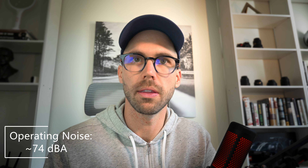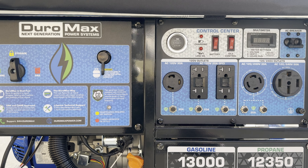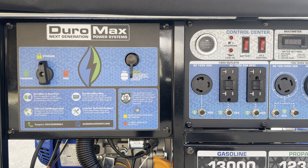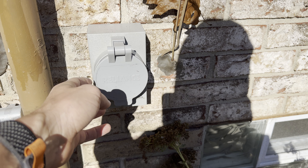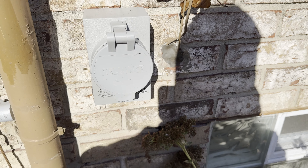It's not overly loud — it's about as loud as you'd expect for a 13,000 watt generator. I've actually had lower wattage, like 7,000 watt generators that were louder, so in comparison I think that's pretty good. Usually when you're running a generator, other people probably are too if it's a power outage, so it's not a big deal. This thing has plenty of outlets — it has a 30 amp and a 50 amp. I use the 50 amp with a breaker into the side of my house to power the whole home. I highly suggest having a whole home interlock system if you're getting this generator.